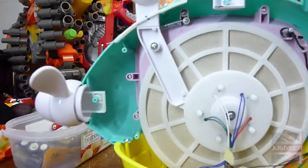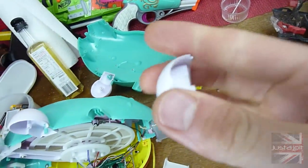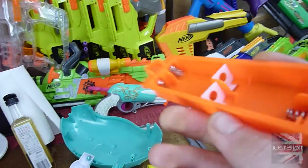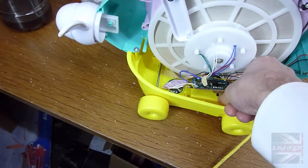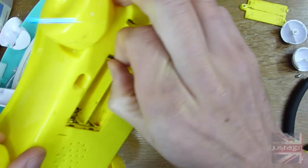And so for anyone who's interested, there are the internals of a pinky ponk nonk stinky. Might have to epoxy that later to get it looking right again. You can see the corrosion right there - that's no good. What I'm going to end up doing is swapping out this contact right here that's all corroded. I think this might be a hail fire - I think that contact might fit. So we have now desoldered this circuit board from this connector bit right here. I'm going to bend this up and it should just be a case of pushing it out.